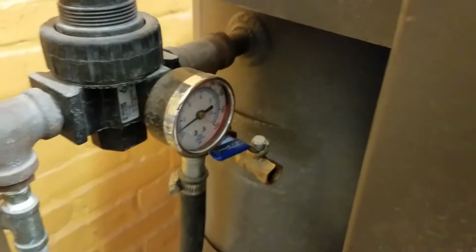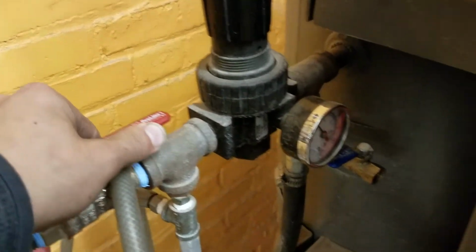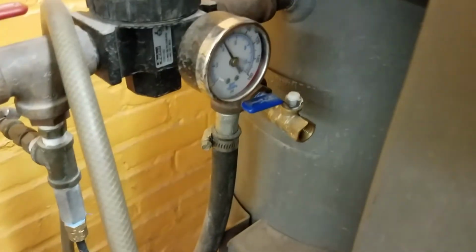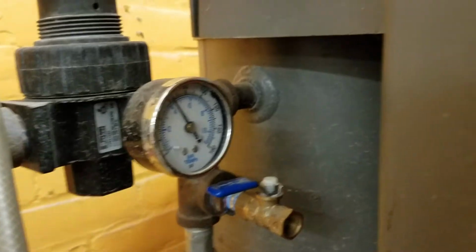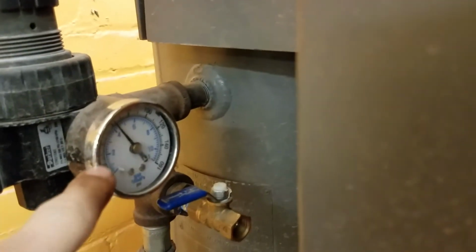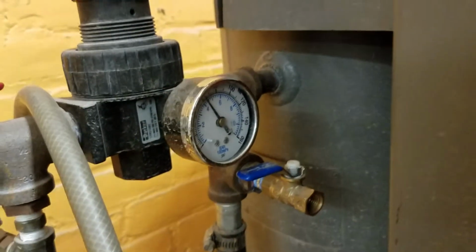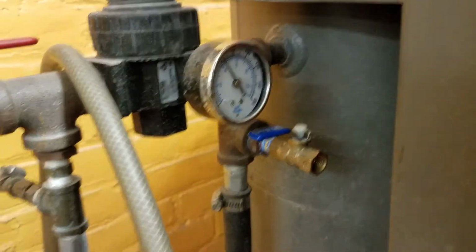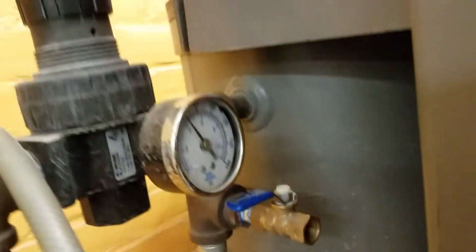Now it's making that seal. We can see the pressure going up. Open this all the way. And you can hear a hissing sound, which is okay. It's some air escaping from the foot pedal through a release valve. The pressure should be set somewhere between 20 and 80 psi, depending on what you're doing. So it's a little hard to see from this angle, but 20 is down here and 80 is up here. So you'll want to change that. You can play around with that. Right now it's sitting around 60, so leave it there.